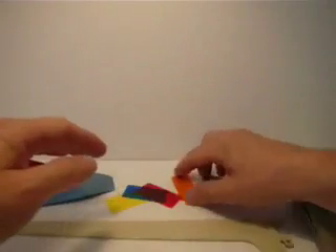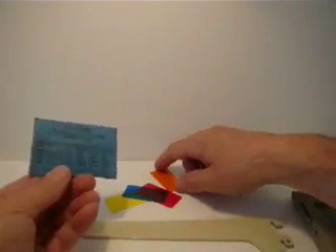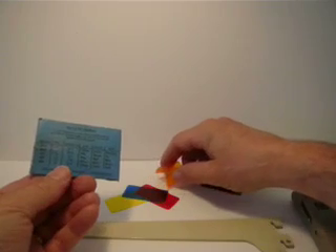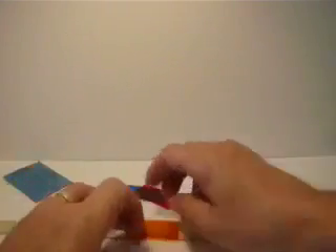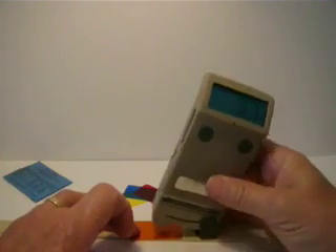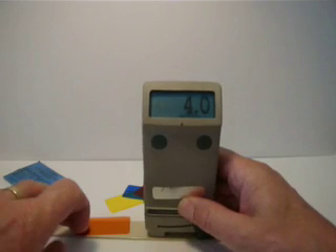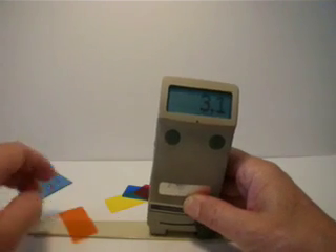Now I'm going to take out the plastic shims just to gauge it for you. The thin ones are the least accurate. The orange — or amber as they call it — is 1 mil. Let's start with the 1 mil. Place the film on the surface and get a reading: 4.2. Remove the film: 3.1. So there's your mil. These vary from 5% to 20% variation.